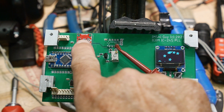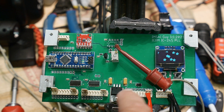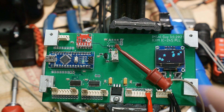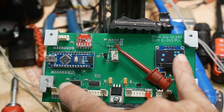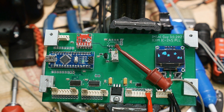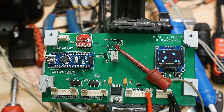The other thing I loaded was the DAC, so it's time to write some programs. I'm going to write a program to display a number — I'll display it on the display here, and also on the front panel using the LEDs, and we'll see if they match. I'll have it count. After that I can output voltages on the DAC, display the bit count I'm outputting, and then measure the voltage coming out of the DAC. Then we can talk about the offset and gain we need in order to make everything right.